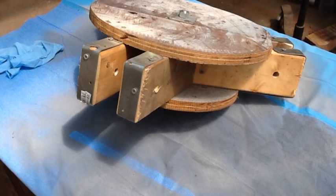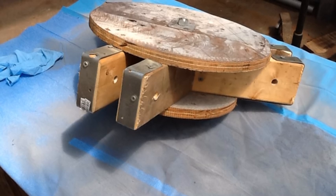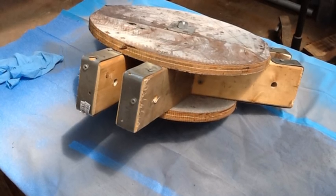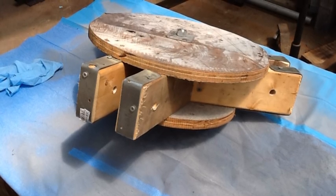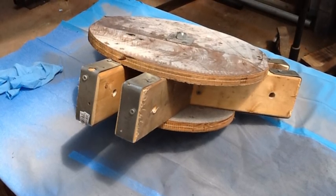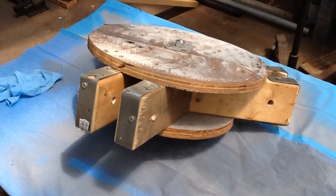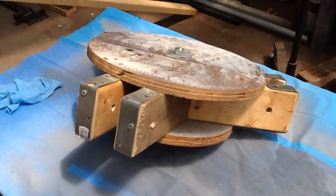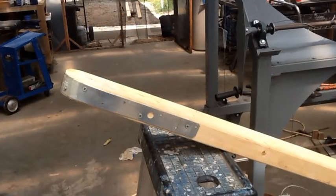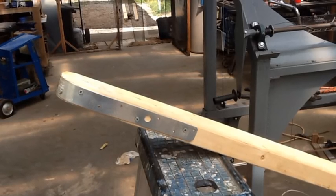The head was built out of two rings of plywood — three-quarter inch plywood. The top one is about 14 inches across, the bottom one is about 11 inches across. Radiating out at 30-degree angles are 2x4s that have been wrapped in steel tie-down strap. This will keep the 2x4s from splitting and twisting under load. I made the legs of the tripod by rounding the ends of three 10-foot 2x4s and then adding steel strap to those also.